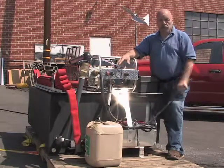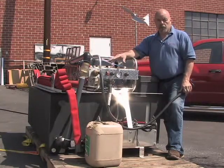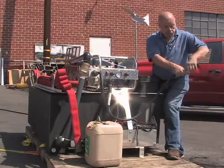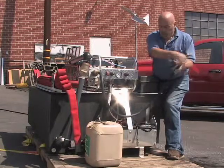This one's chugging right now because the nozzle's too small. If it chugs, you don't have a big enough nozzle — it's taking too much pressure to pump it through. If we put a bigger nozzle or take this one off, we get more flow out of it because it's not restricted.